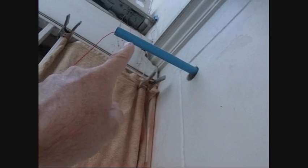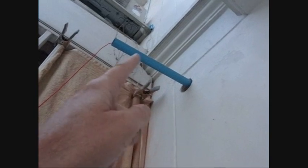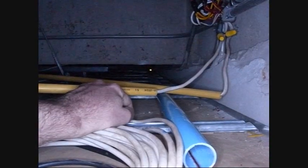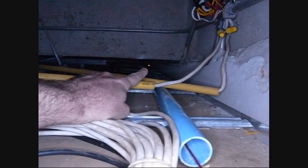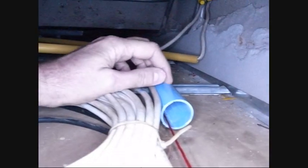So here's where we are right now. We've got this piece of pipe that goes into the house and it runs above the sheetrock — the gypsum — in the house to where it needs to go. We're going to run down here. We'll be using sweeps because you don't want 90-degree turns with fiber. Run along the air conditioner pipe and over to that hole. Here we are up above the sheetrock. You can see way down there at the tip of my finger — that's where it comes into the house. And obviously you need to seal that up.